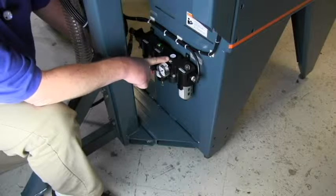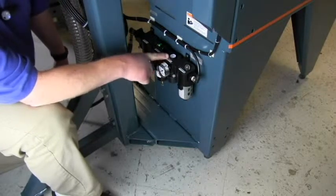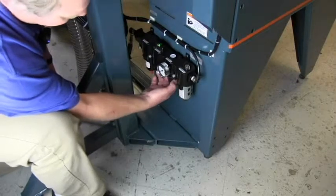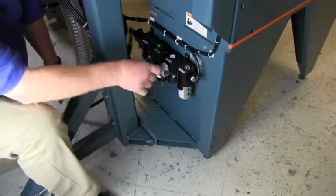The next unit up is a regulator. The Norfield machine wants to be set at 90 psi. The adjustment for the regulator is at the bottom. You loosen the thumb screw at the bottom of the knob and turn the knob, screw it in to increase the pressure, screw it out to decrease the pressure.